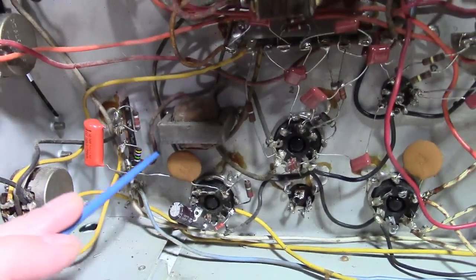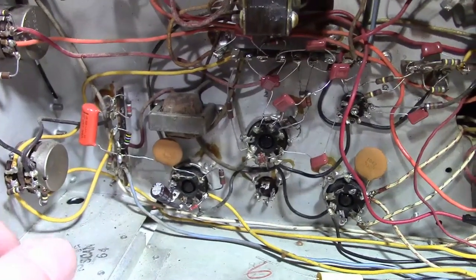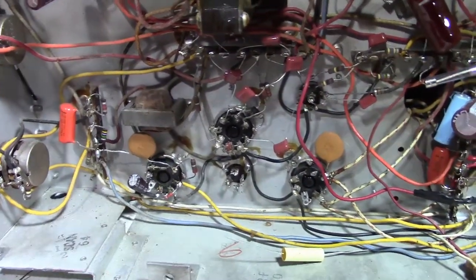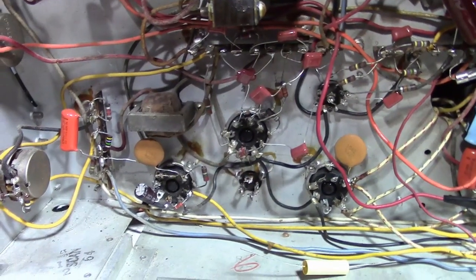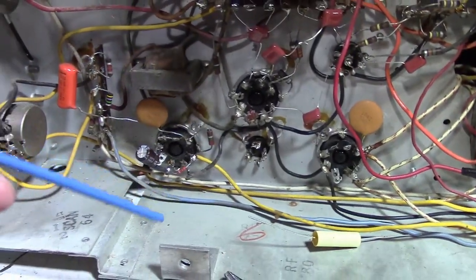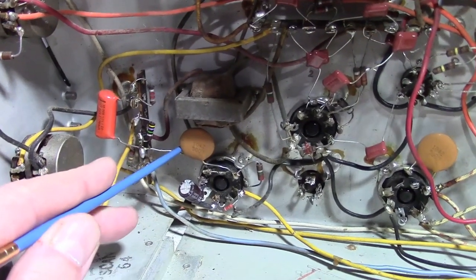Another aspect is the dielectric type. There are a dozen or more different dielectrics you can get that all have different characteristics. Some don't vary as much with temperature, or they vary with temperature over a certain range more than others. Like maybe at room temperature, they're fairly stable, but you get above 100 degrees or below freezing, they might vary quite a bit more. But if it's kept within a narrow range, it doesn't vary so much. And there's also a type they used to call NP0, now C0G, that are very temperature stable and don't really have that property of changing capacitance with applied voltage. However, there's a trade-off. They don't have as much capacitance per unit volume, so you typically only see them in the picofarad range, and they cost more, and they're bigger. Maybe if you looked really hard, you could find a 0.1 microfarad C0G cap for 500 volts. Probably not, but if you did, it'd probably cost you 20 bucks or more, and it would be huge.